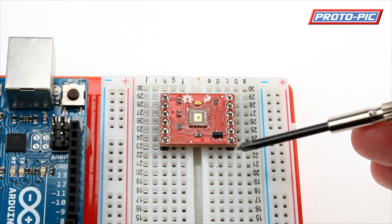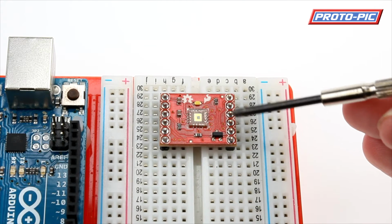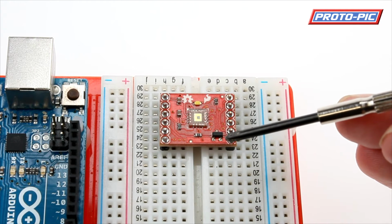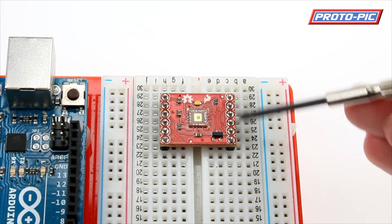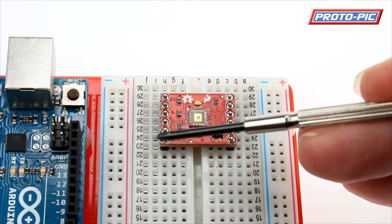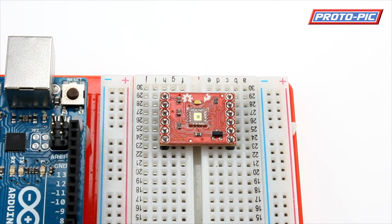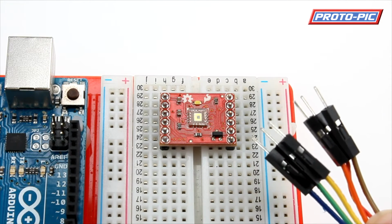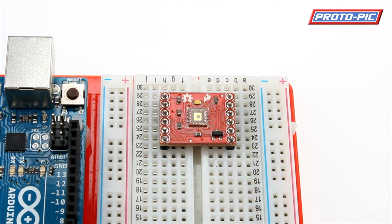On the other side you have these pins. They're marked in pairs for setting the amplification or the gain of the output. With the Arduino it's not required, as a 3 volt output is fine, and the amplification factor is set by pulling all of these to ground. So what I'll do is I'll hook up this side to the Arduino and hook up this side using ribbon strip connectors like this, 2 pins, 12 down to pin 7. So we'll hook up the other side first.